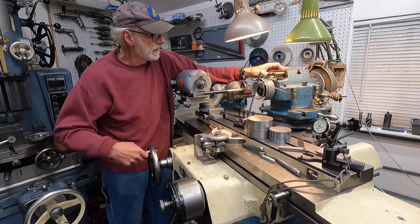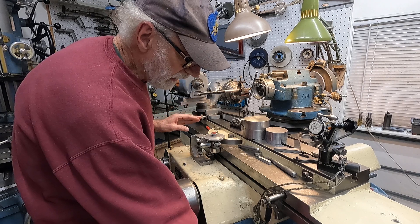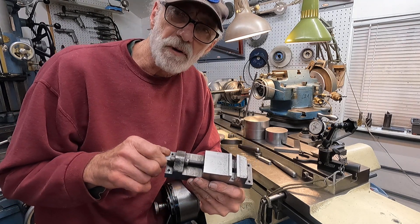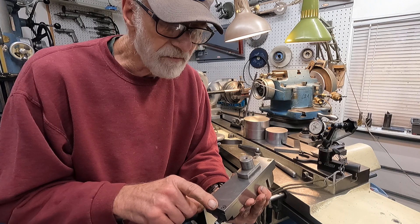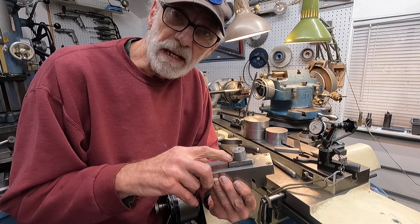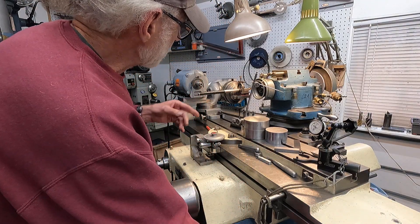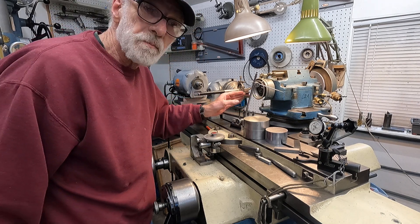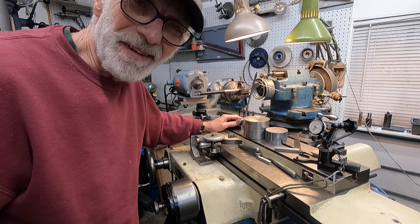I got the machine all lubricated and switched from the vice to the v-block. The vice is something I found on eBay — I'm not sure if it's for a tabletop milling machine — but somebody put a plate on the back and I added a little nub so I could put it in a one-inch 5C collet in my work head. I switched that out to the Starrett v-block, which is a combination v-block with threaded holes. I put a one-inch threaded shank on it so you can position it in any of those holes for different positions.